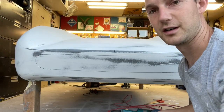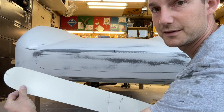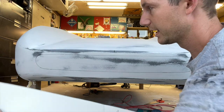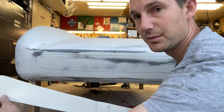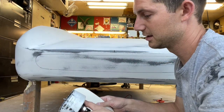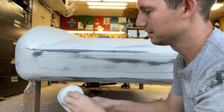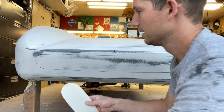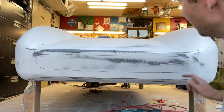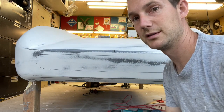So for the front of the car, I made this kind of based off pictures and then based off of the big full-size drawings I have. And again, it's about proportions, not about perfection. So for my ends, got a, what is this, 3.5-inch hole saw. Seems about right. So I'll core through here and there, and then kind of fine cut along the straights, and then chainsaw away a bunch of the bulk.